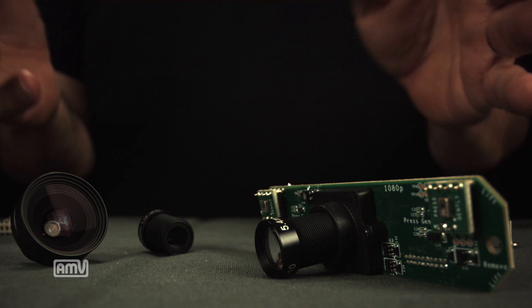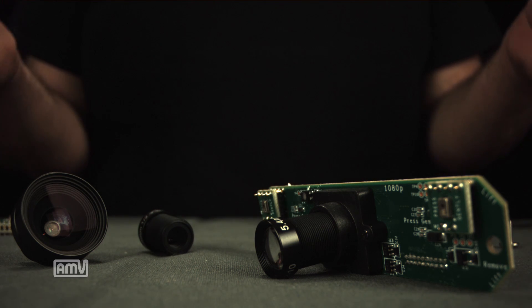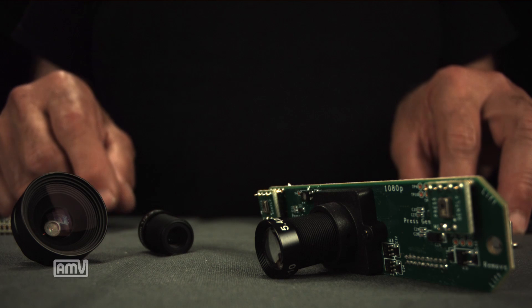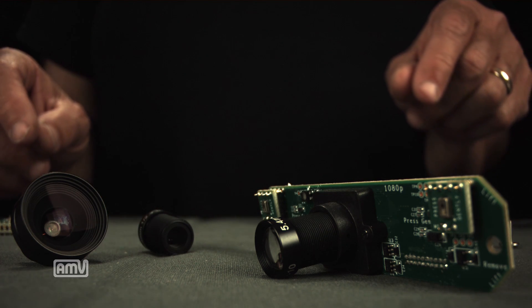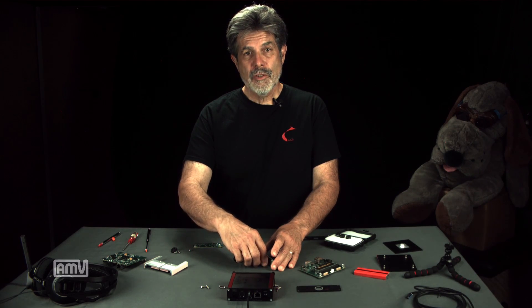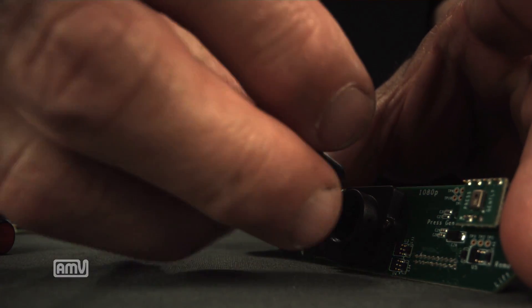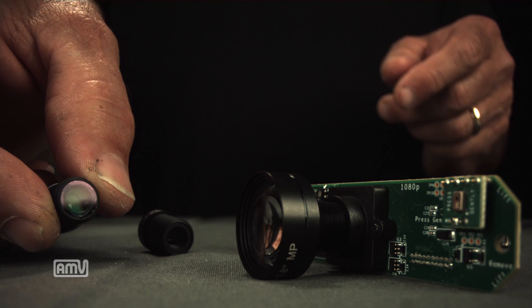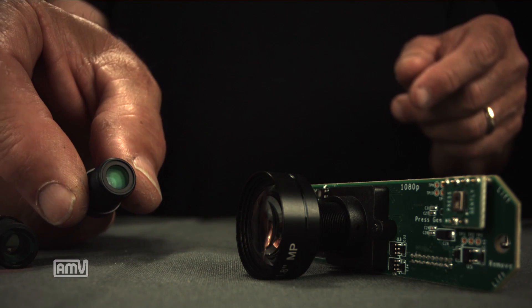When we designed the Sub2R camera we wanted to give the user as much control over the imaging process as possible from the moment the light hits the camera until it leaves. It all begins when the light enters the lens. We chose a 12 millimeter lens because you can get very high quality lenses that are very affordable — much better optical quality than a 1 millimeter or pinhole lens on a mobile device, and far more affordable than a 25 millimeter lens on a scientific or professional camera. We've made it easy to change the lenses; they simply unscrew. It's also easy to change filters — this one has the IR cutout filter on it and this lens comes without.